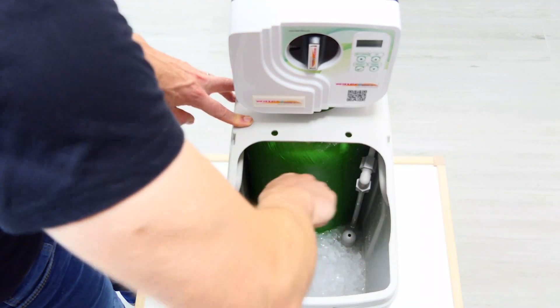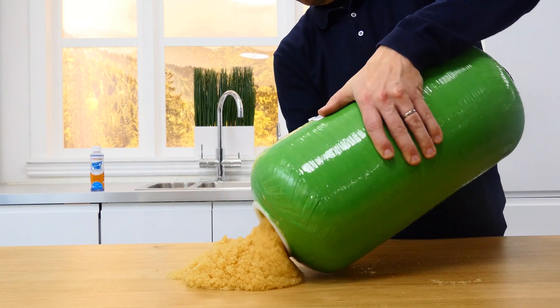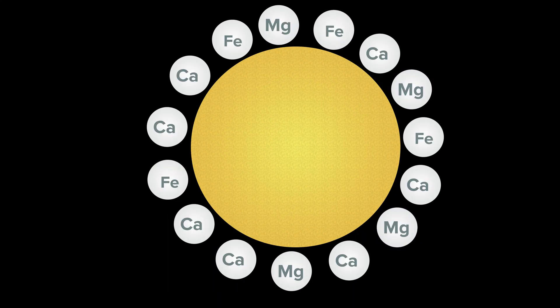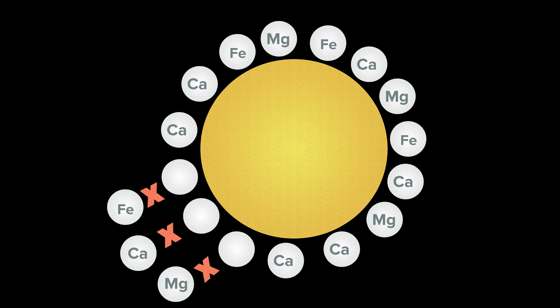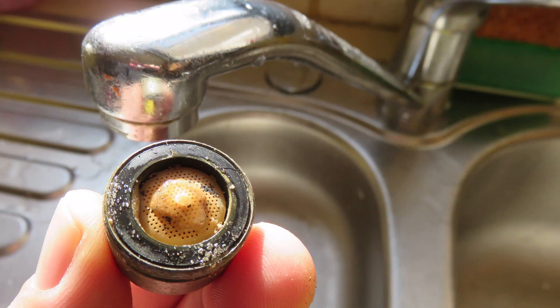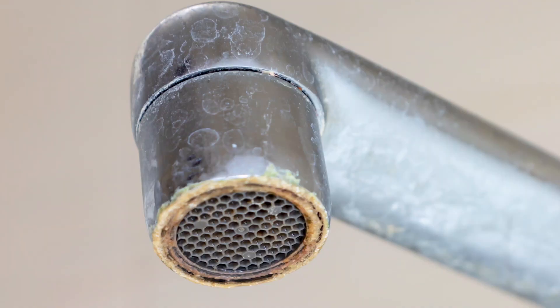Now that you have checked for bridging, we are going to bring the resin back to a healthy state. Over time, ions of magnesium, calcium and iron build up on the resin, forming a limescale layer around the resin bead preventing any more limescale sticking to it. Only the use of a resin cleaner will remove the build up of limescale on the resin. Failure to do so will stop the water softener from working and it will no longer be effective in removing limescale.